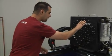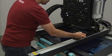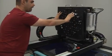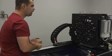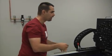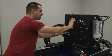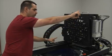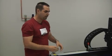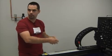And this has 6 motors. It has an XY, so here's an X position here. Also, this part moves forward and back, so it's the Y position. And then each of these has a motor behind it that will control for rotation. And Patty's the second series of a robot, which we used to call PD. PD used to have 1 probe that would go down. Patty has about 80 of them. And what we can do with these is put down more than one at once and then do gestures like stretches and zooms. So this gives us a very nice, easy way to do multi-touch runs for, let's say, a week and simulate what we'll have out in the wild when our Surface 2.0 is out in public.